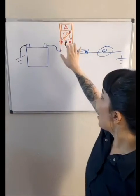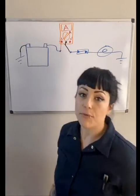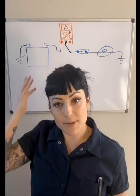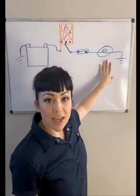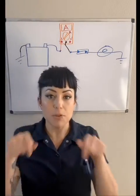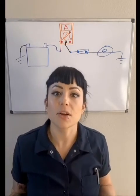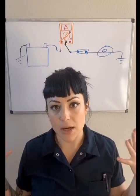This is super common. You could theoretically take out the switch, but then you lose all control of the circuit. What you don't want to do is unscrew your load and put the meter in series, because the meter in amp setting has no ohms. If you remove resistance from the circuit — say you remove a light bulb in a series circuit and put the meter in its place — you'll get an inaccurate reading because you've changed the resistance, so current flow won't be what it normally is.